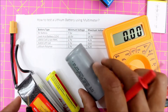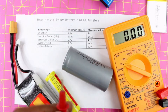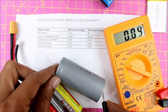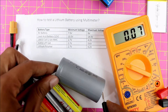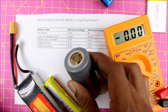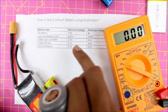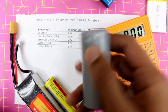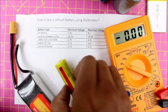Next we have a lithium battery. We need to find the positive and negative terminals — here the left side is the positive terminal, so I'll switch my probes and measure. As you can see, the voltage keeps fluctuating and never crosses 1 volt. This cell is pretty much damaged because the minimum voltage it should have is 2.7 volts. You can also see physically it has sustained damage due to water leakage, so this cell is completely damaged and cannot be used.